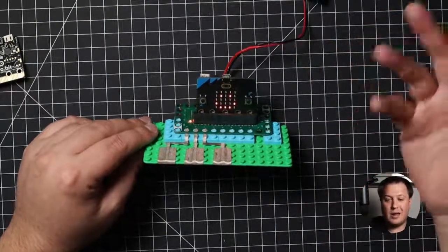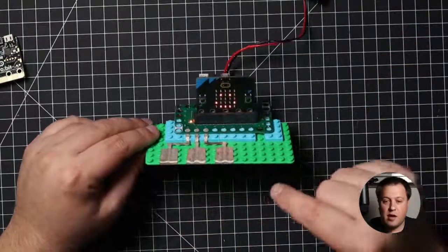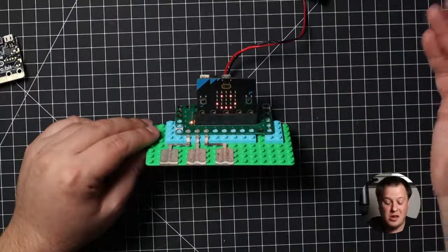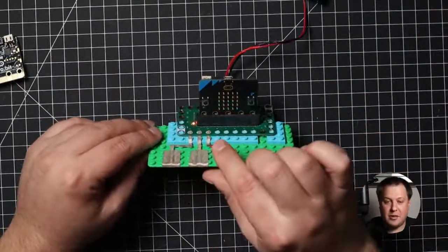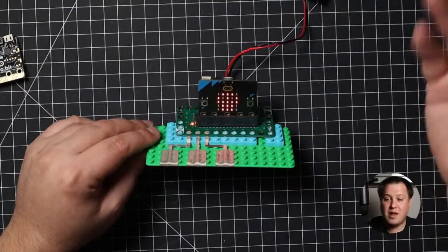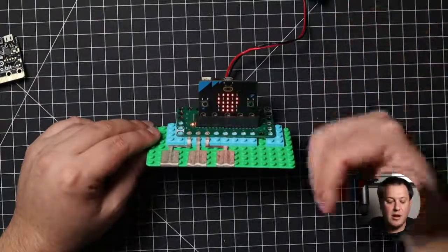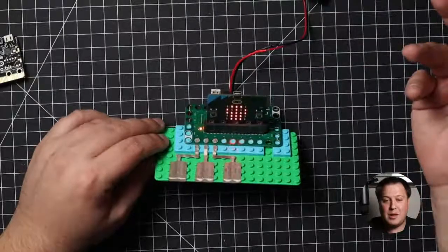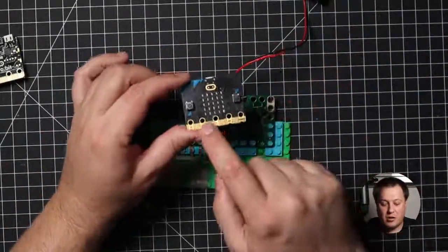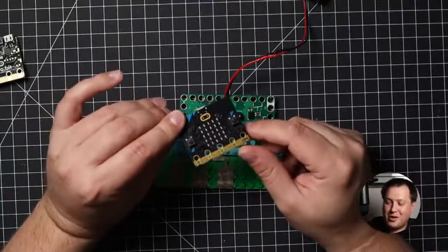We're pressing a button that's playing a quote from 2001: A Space Odyssey. And we're just going to do the same thing here, but with a micro:bit and many fewer touch points, because we only have up to 4 to use. Same exact setup, just with a micro:bit, which is kind of a cool project to do, because, again, kids could use all sorts of things to activate that touch point. Heck, you could just use alligator clips. You don't need to use our board if you're just going to do some funky stuff. You could just alligator clip over from 0, 1, and 2. And then, actually, you'd have no other points to use, would you?